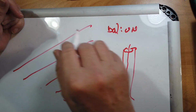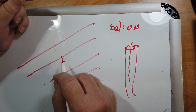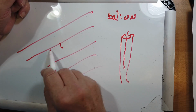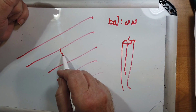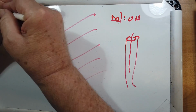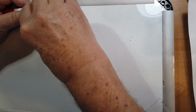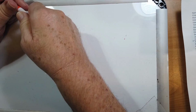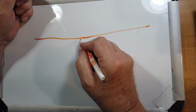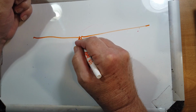This thing turns all the way around. It's very difficult to feed with open wire line. Besides which there'd be an impedance mismatch unless you reset the match that's right there. Okay, so what you are trying to do, and I'll just illustrate this with a single antenna element, we'll just use a dipole. And we've got feed down here, and we'll make this coax.